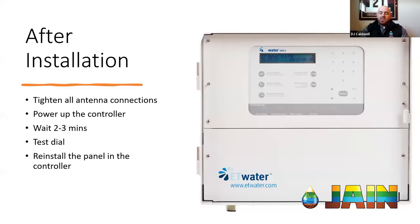Once you're plugged in, you've got your modem set in place and your antenna cable is connected. There are just a few more things we recommend doing while installing the modem. One: make sure all your antenna connections are tight. This is one of the few things that causes calls to be missed — we're in the back of the controller moving things around, so it's always good to double-check that everything is nice and tight.